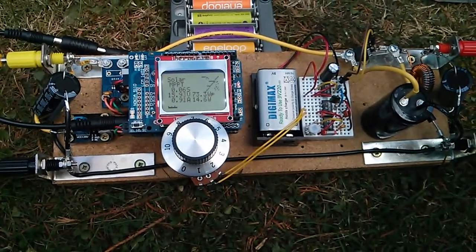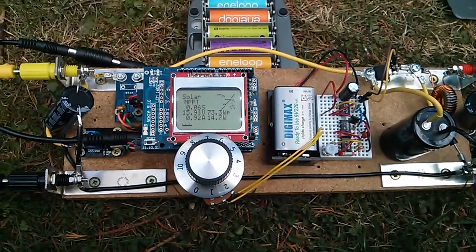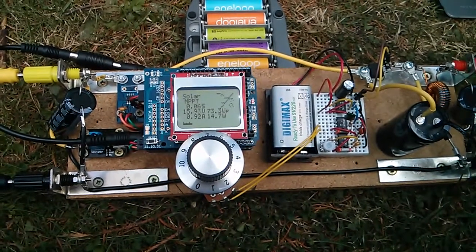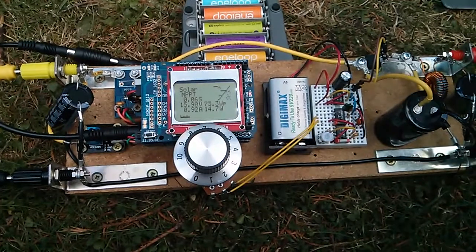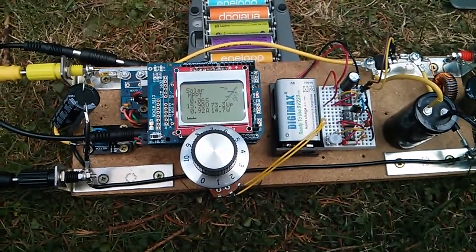That's because the Arduino — I've now got a method of getting it to generate the 15kHz frequency. I've also devised the dual complementary opto-isolator driver so that the Arduino will be able to drive the MOSFET to switch it on and off.